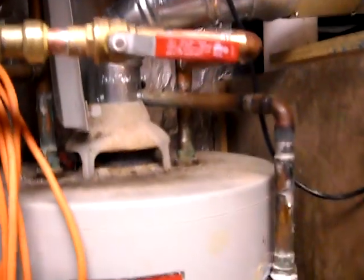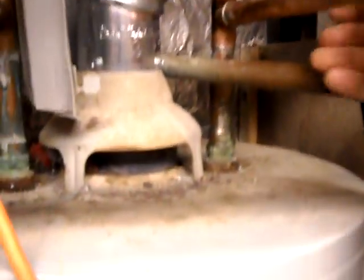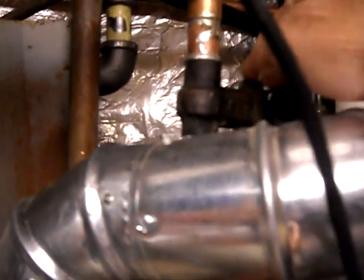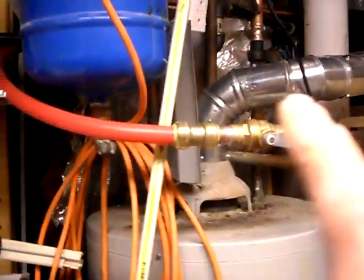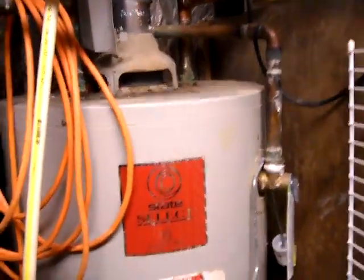I'm in here where the water heater is. Here's my cold water line up here, connecting again with a shark bite over the PEX. Here's my hot water line — I've got a water valve on there, and then this valve right here goes down into the water heater. To cut off the cold water supply to the water heater I just close this one. My hot water from the solar panel comes in here and goes down into the water heater.